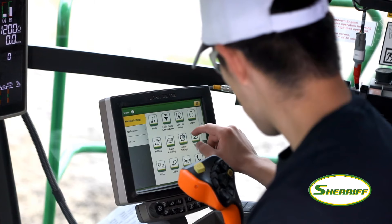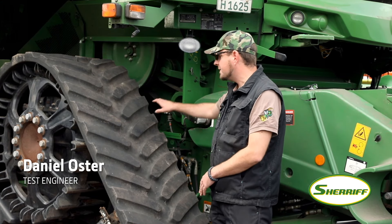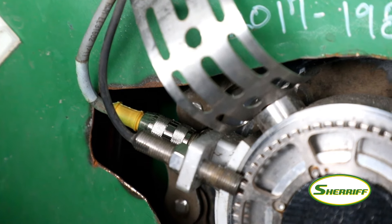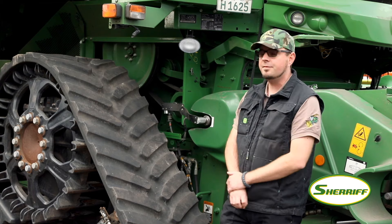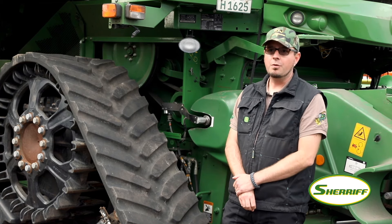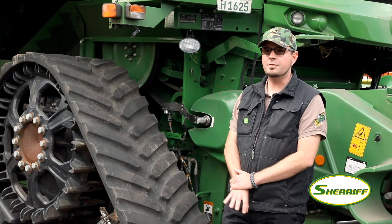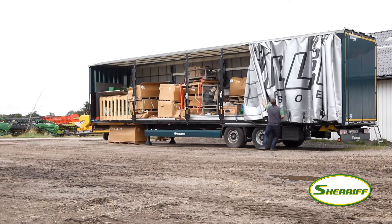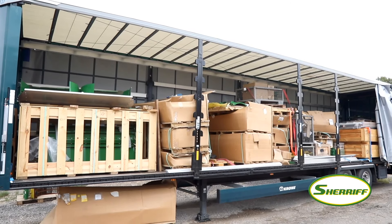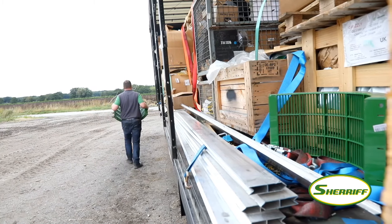On this combine we put a lot of shafts out of the machine and put strain gauges on, and now we are able to measure the torque of all of the major functional components on this combine. The goal is to get an understanding of how the power is distributed through the machine.